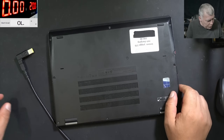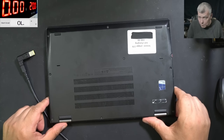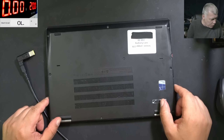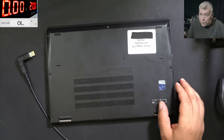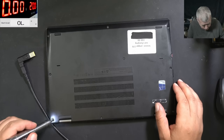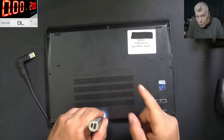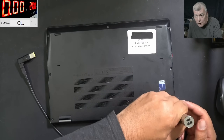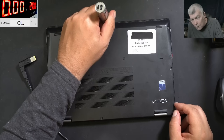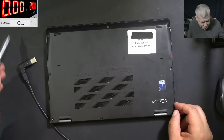Based on the fact the voltage is getting dropped to 2.8 volts, there's a short — clearly we have a short. It's after the input circuit, after the first two MOSFETs. If the voltage on the power supply was like zero, then the short would be near the charging port. Easy pizza — or what do you think? Easy pizza or not?